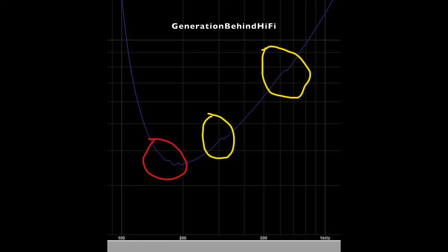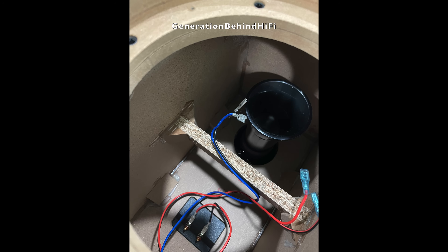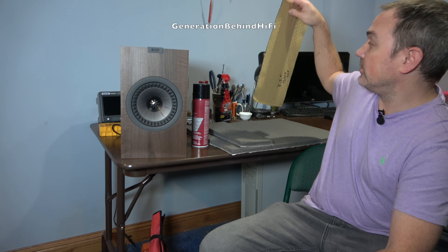I'm hoping that by adding some additional damping material and sound deadening material to the inside walls of the cabinet, it will resolve two problems: the cabinet resonances and the somewhat boxy sound I am hearing. I think the boxy sound is caused by the lack of sufficient damping material inside the cabinet. By adding damping material, the sound waves radiating from the back of the driver will be absorbed instead of being free to bounce around and excite the cabinet. So you're probably wondering what products I'm going to use to combat those cabinet resonances.